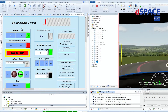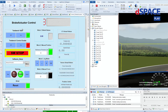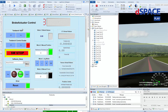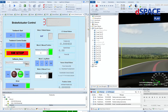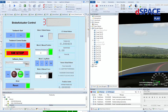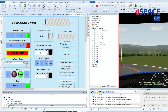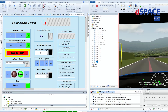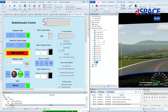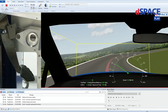On the left side you can now see the brake actuator control layout, where the important settings and measurements are displayed. If you have two different types of pedals or brakes, the software adapts automatically by doing a homing. Here we can switch to our ASM control mode — ASM means Automotive Simulation Model. In this mode the test bench gets its set point from ASM, which simulates a car driving on a road. On the right side of the screen you can see the motion test and the simulated maneuver, and on the left side the linear actuator pressing the brake pedal accordingly.